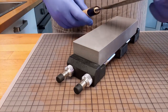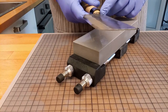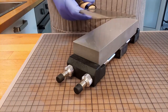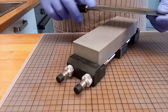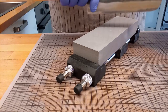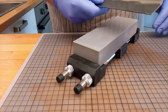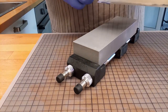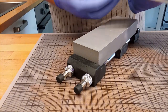One thing already was, I filled the gaps between the blade tang and the handle with very simple construction adhesive, good enough in my book, that was available to me at this particular moment. Very sharp edges, so I use my Nakiri in this grip, so you can see this contact point is not very pleasant. The edges will be sanded, these edges too.